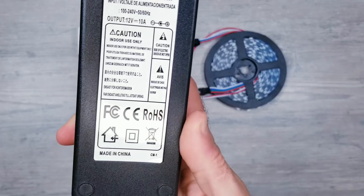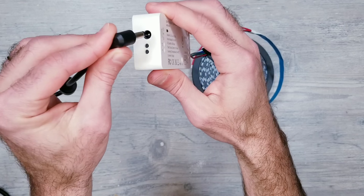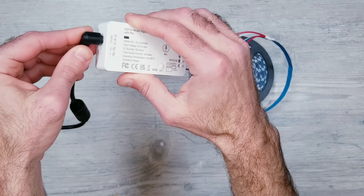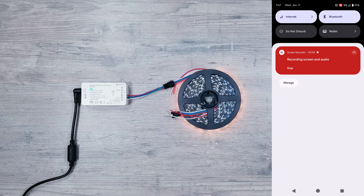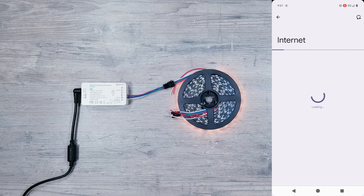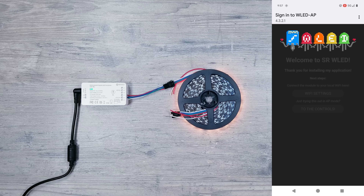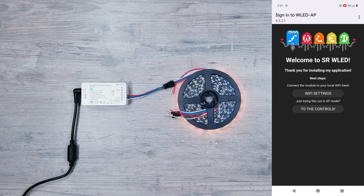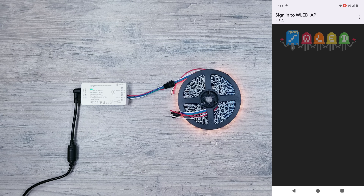For power, since these are 12-volt LED strips, I'll be using a 12-volt 10-amp supply that should be more than enough to drive a good amount of these lights. The connection process is the same as always: open up Wi-Fi, look for the WLED-AP network, and if it asks for a password, put in WLED1234. If you're somewhere without available Wi-Fi — like a cabin or festival — hit controls and you're ready to go since you're directly connected to the module's Wi-Fi access point. But if you're at home, I'll generally always connect it to my home network.